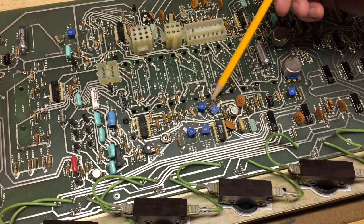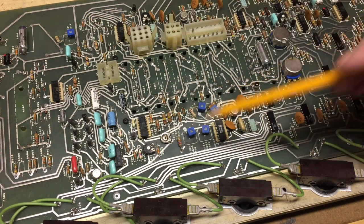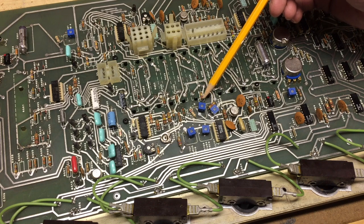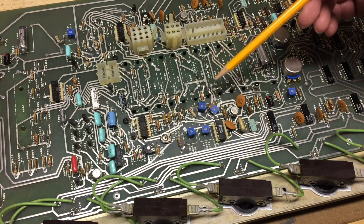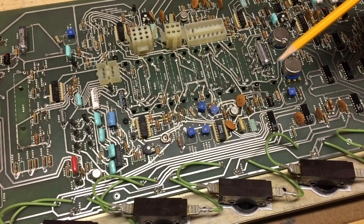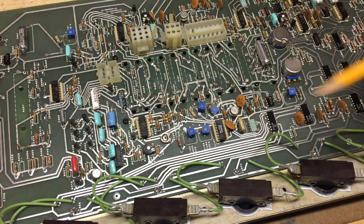I have replaced six potentiometers with these new CERMET potentiometers and have added five resistors in series per the schematics. Now interestingly, on the back side of this there was some printed circuit — essentially a dead end, starting nowhere and going nowhere, ending in two terminals — which lends itself really well to placing these resistors in series per the design documents. These resistors weren't there before, but the printed circuit was. It's almost as if Moog had designed it to have these added later, which they may very well have done. So I took advantage of that and also replaced the two electrolytic capacitors. We're going to reassemble the whole thing — here's hoping it works. Let's give it a shot.